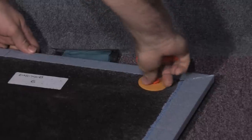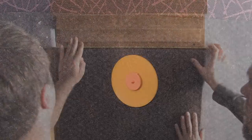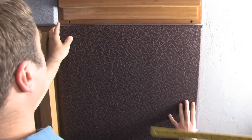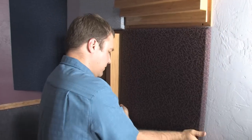For our regular wall-mounted panels, I will be using an alternative called Rotofast Snap-on Anchors. This system I find a little easier. You first screw the anchor into the panel towards each corner. Next, you insert a marking pin into each anchor. Then you place the panel on the wall in its final location. Press in and then remove. This will mark 4 holes in the wall. Now screw the supplied plastic ratchets into the marks on the wall. Remove the original marking pins and place the panel on the ratchets, pressing the panel towards the wall.